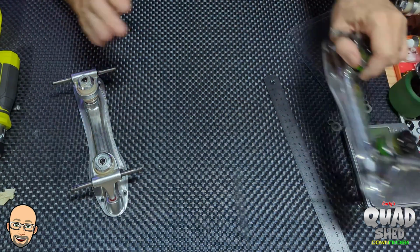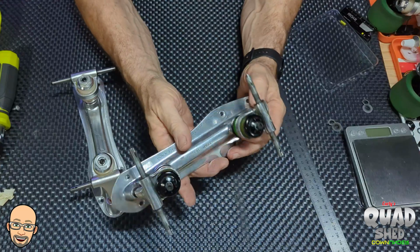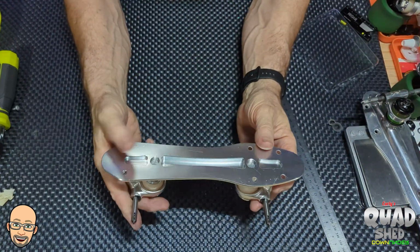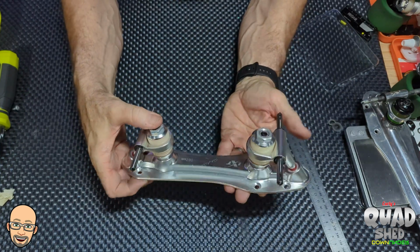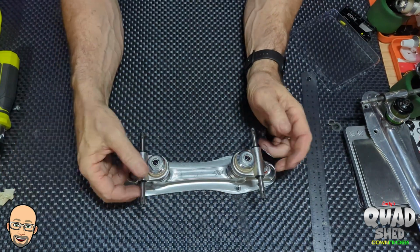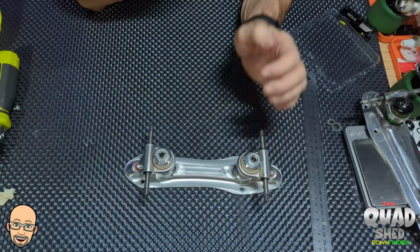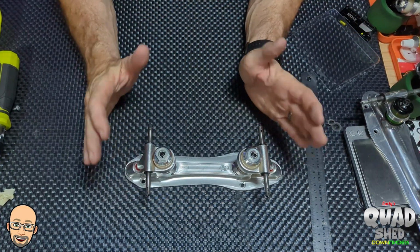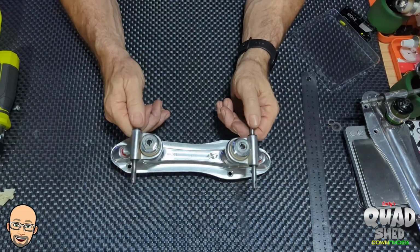Being an old molder, I actually like castings, but these were pressure die-cast injection molding, and these were basically from a single block of aluminium, 6061, I think. So they were CNC'd from one big piece, which is good. It keeps it consistent. It's all run by computer, so everything should be consistent, where the injection molding had some issues. Apparently it was a different company as well. So first off the bat, they are chunkier and heavier than the old Zap.